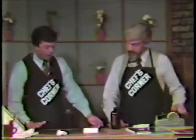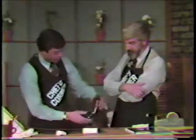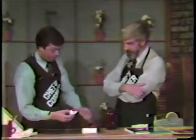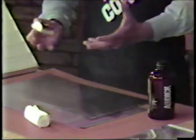Right. After I have desensitized my metal plate, I want to bring the image up. I wouldn't have to because it would still run, but it wouldn't give me the length of run, as you said, that I might want. So I take then this solution, the offset lacquer, using a drop of it about the size of a quarter, and rolling up, or a pad, or whatever I have, I go across the plate and bring up the image. And I can check it, I can look at it, I can make sure that it's correct.